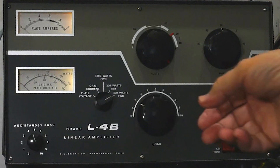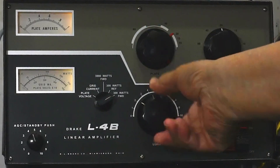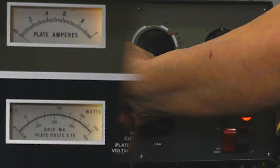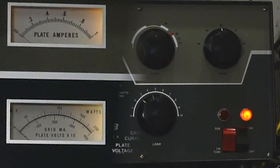I'm going to up the drive to about 25 watts or so, and keep one eye on the grid current meter and the other eye on a Bird watt meter sitting to my right. I've increased the drive and the load control is going to come up. I'm tuning for max out and I take the meter at 300 watts. I've increased the meter to 3 kW. Plate current here is a couple hundred milliamps.